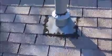Now, whoever did the repair here was a very inexperienced roofing contractor, and he never overlapped the flashing. You can see the flashings all open here, and they put nails here. So eventually this will develop a leak. So I'm going to recommend to the homeowner to redo this area.